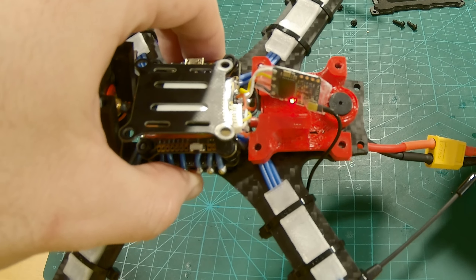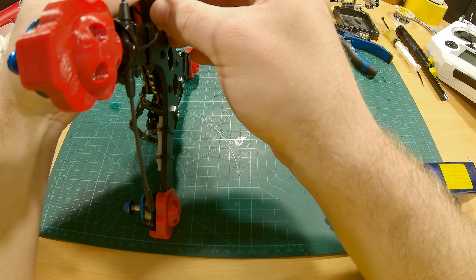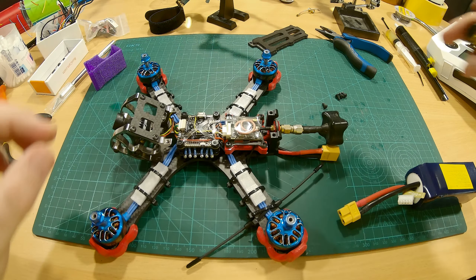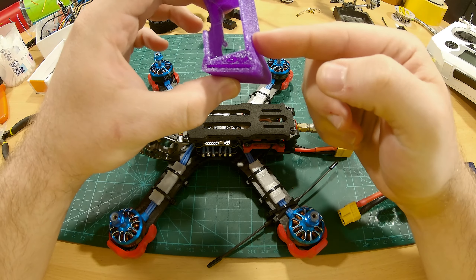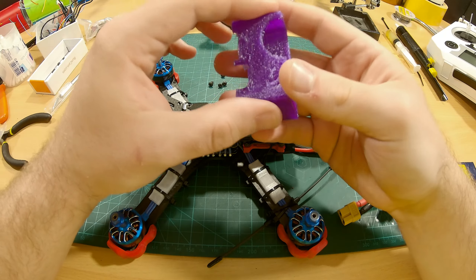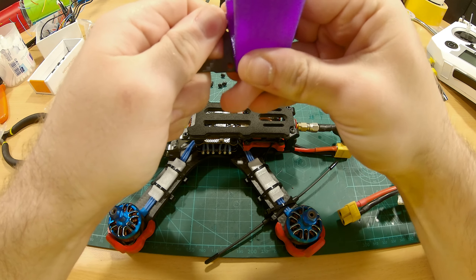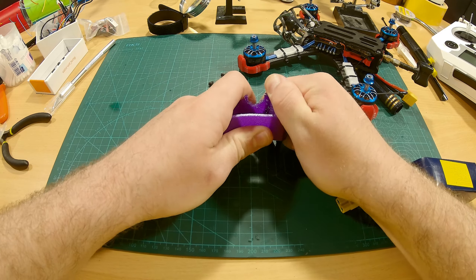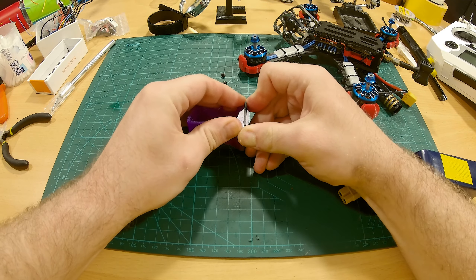Make sure all our soldering is still good. Now we're gonna reattach our standoffs here and add these four screws. Put our top plate back, then remove this plate so we can attach our GoPro mount. This is printed out of TPU — flexible filament — I designed this in Fusion 360. My friend uses a GoPro Hero 3 which doesn't have a lot of mounts for the Chameleon TI, so I made one. It also accommodates an extra 15 degrees to have a 25-degree angle on the camera. Push this carbon piece in — it's a very tight fit on purpose. You can find all my models in the description.